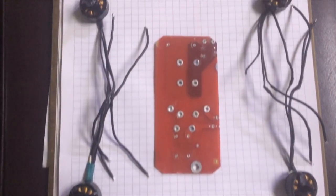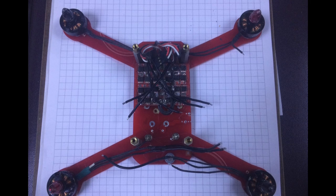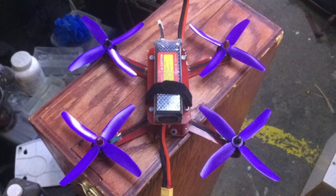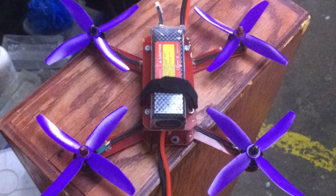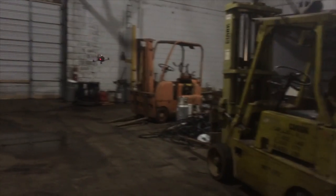These are the motors we'll use — they were pretty busted up, but nothing a complete motor rebuild didn't fix. The four motor arms were bolted onto the frame and the motors were mounted to each arm. Then the electronic speed controllers and flight controller were mounted onto the bottom chassis plate. Finally the top plate is screwed down, props added, and it was topped off with a 1500 milliamp hour 3S LiPo. It's time to take this drone downstairs for a quick test flight. It's pretty zippy, considering the whole thing is basically a flying circuit board — it only weighs about 190 grams without a battery.